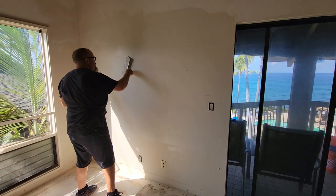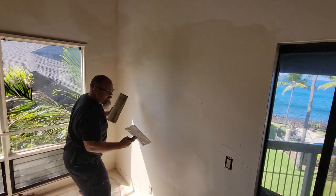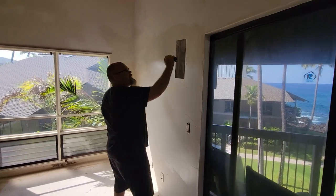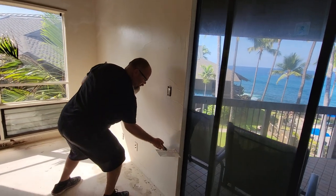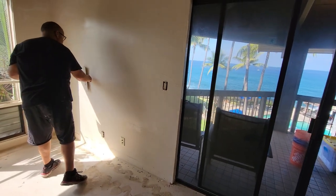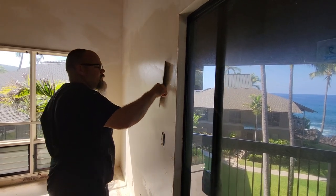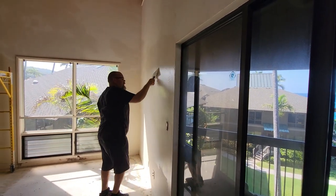This is something I do in just about every rental that we have. If there's ever any damage to the wall, it's so easy to come in and patch. For instance, I had an AC unit updated in another unit, and the guy putting in the AC stepped through the ceiling — and I had renters coming the next day. I got some hot mud that dries in five minutes, patched it, did this texture, painted it, and got the repair done in about 30 minutes, where normally it would take much longer. That's why I love this texture — it's so easy to fix.